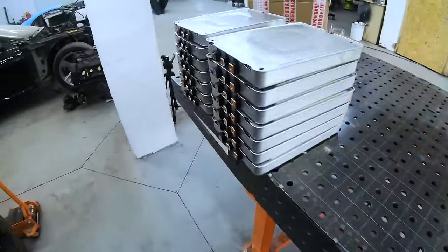Hopefully we won't burn anything out. We'll raise the rear axle just in case the van plans to go somewhere, since none of us really understand how the automatic gear will behave. A lot of people had a question in the comments about why we use an automatic transmission - we'll talk about this in the next episode when we fully test the car. For now, the task is just spinning the wheels and checking all connections. We suspended the rear axle in the air, checked everything once again, and got ready for the first launch. Gas and brake will also be implemented via DAC modules - digital to analog converters - with analog triggers sending signals to the ESP32, then to the DAC, then to the PDM.